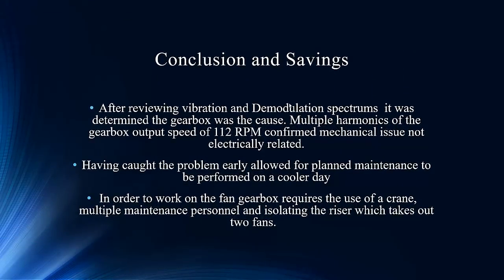What's so important is they found it so they could manage the repair. They were able to schedule it for when it was cool, because in a utility, if it's a hot day and you have to take down a system — when you take out one, you have to take out a whole riser, which is quite a few fans. You need a crane, a number of people, and you lose part of the system. Condition-based over time-based maintenance — the condition warranted repair, they did it when they didn't need to shut down production, and it saved them an unbelievable amount of money. Utilities losing production in the heat of summer lose an extraordinary amount of money.